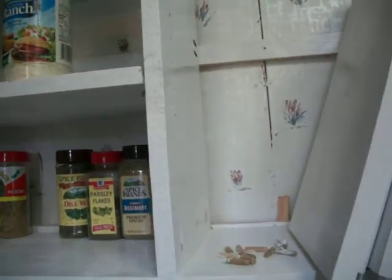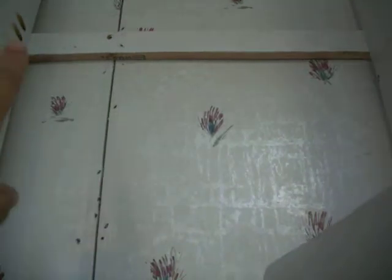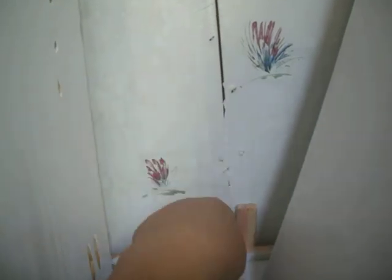But because of the 24 inches on center, I put a third support. Most upper cabinets have a base support and some sort of railing. The top of that one is at 30 inches from the bottom of that one. So that's at 7 feet, 84 inches is that one. And that's leveled, and you notice the difference. I didn't have to put a strip here to make up for the gap. Those were fine. So that's how much the water down here has caused damage.